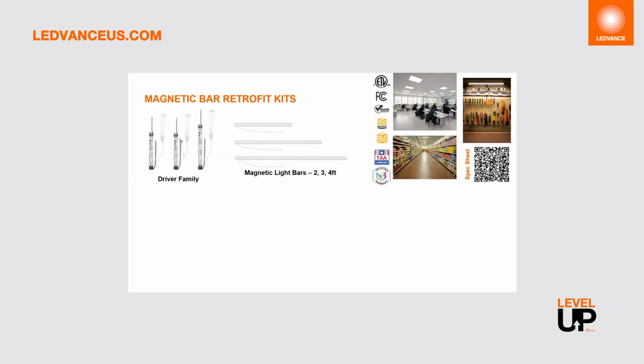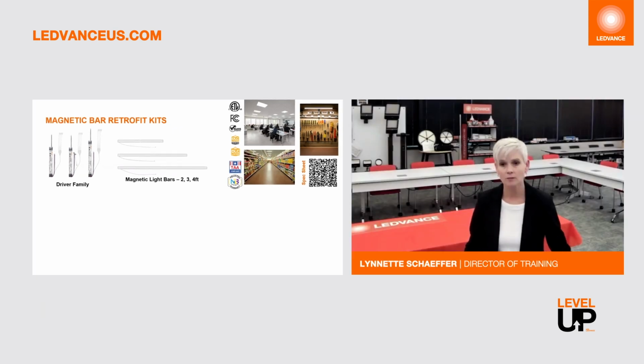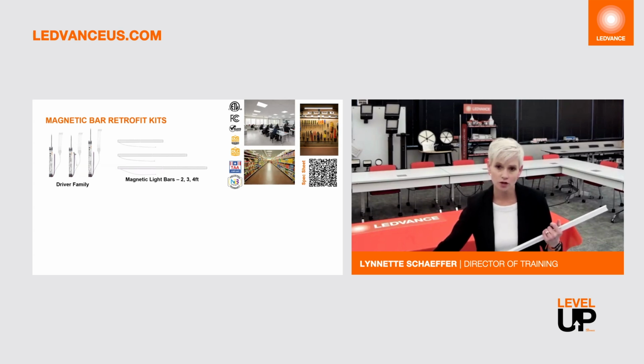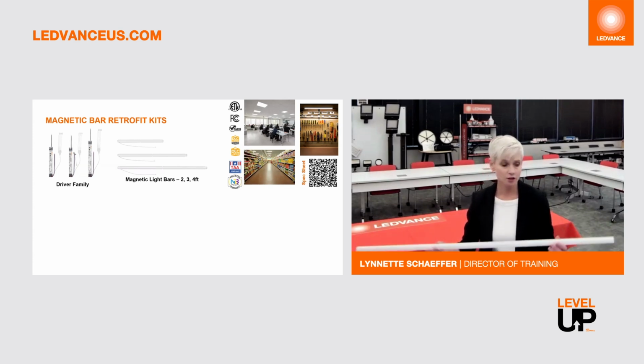Now, these are ETL, FCC, RoHS. They are also DLC Premium or DLC Standard, depending upon the primary use category. When we talk about primary use category, we're basically talking about whether or not they're going to be used in, say, a linear ambient or a low bay category, or if they're more used in, say, a troffer, for instance.